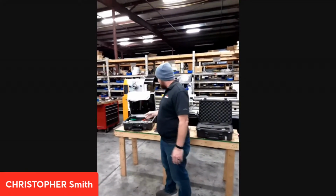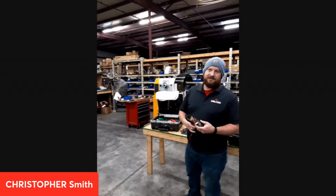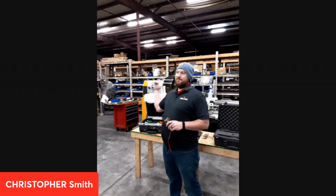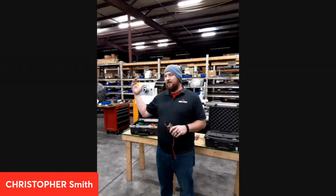Another great thing you're always going to want to take with you is a voltmeter. A lot of times, if your machine's running for a little bit and then shutting off, it can be the amperage. If the warehouse you're in has a bunch of machines all set up and running, over the time of the day everything starts getting hot. So you want to be able to check that voltage, make sure you're getting the correct voltage, and that's not your problem.